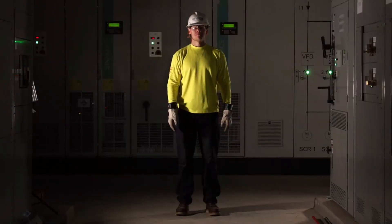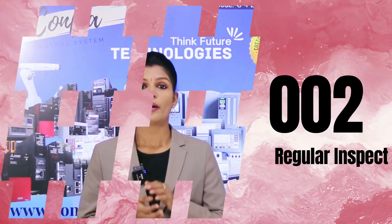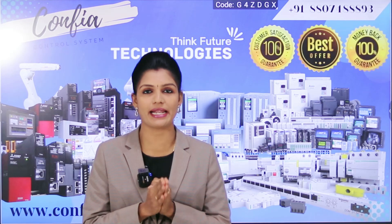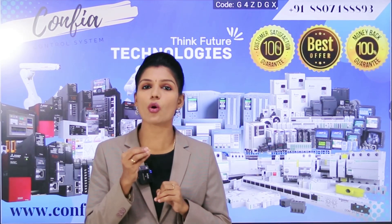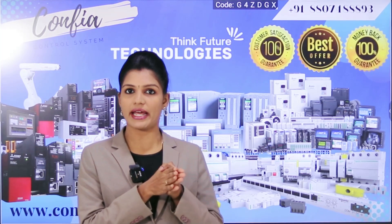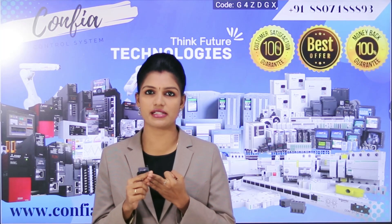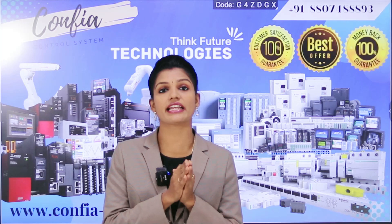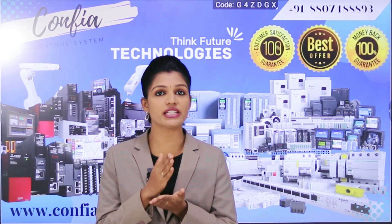Based on your application, you should wear the appropriate PPE as given in the safety guidelines. The second tip is regular inspection. You have to periodically schedule a routine inspection of the PLC panel box to find visible damage, loose connections, or any other issues present in the panel box — ideally weekly, monthly, or quarterly based on the usage and environment where the panel box is placed.